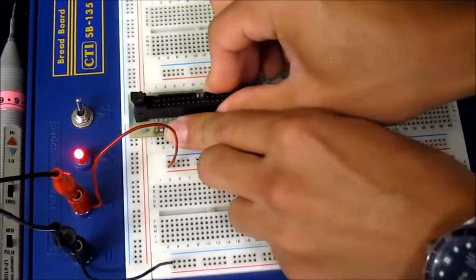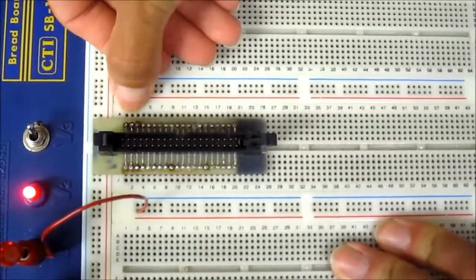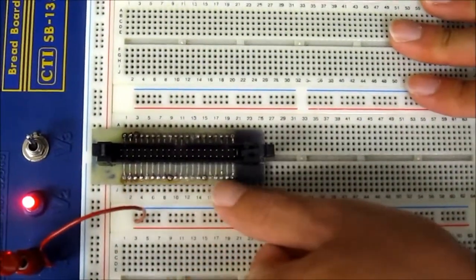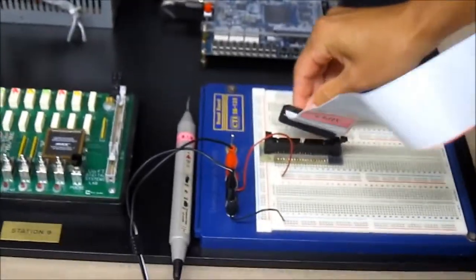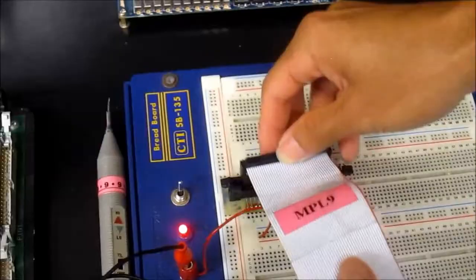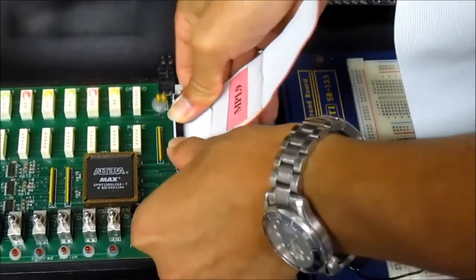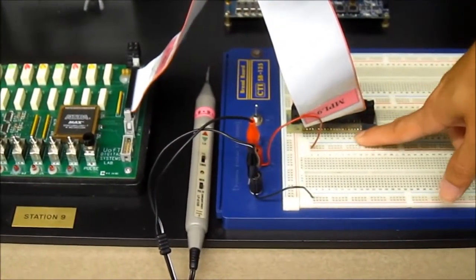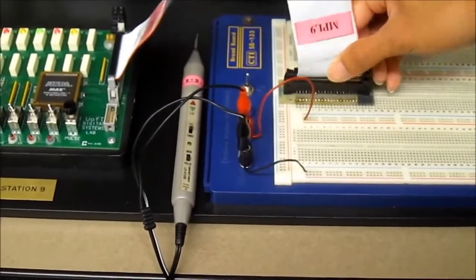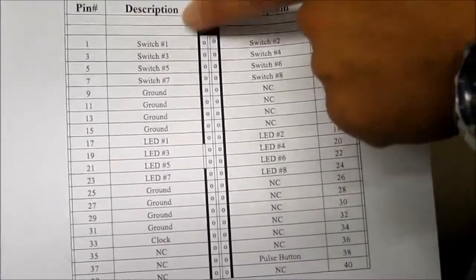Let's line this up in the corner over our trench. When we put it in like this, all of the pins at the top are going to be connected to these holes at the top, and all of the pins at the bottom are going to be connected to all of these holes at the bottom. Next, we'll hook up our ribbon cable — plug it in here, making sure all pins are straight, paying attention to the notch on our ribbon cable. We'll hook it up here and also to our switch and LED board. All of the pin numbers for the switches are going to be listed in your handout.